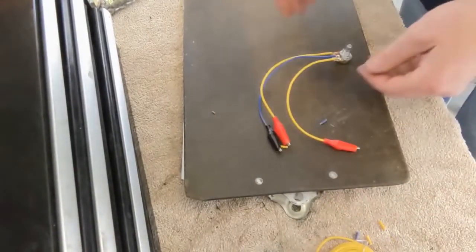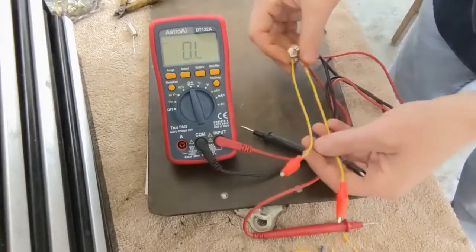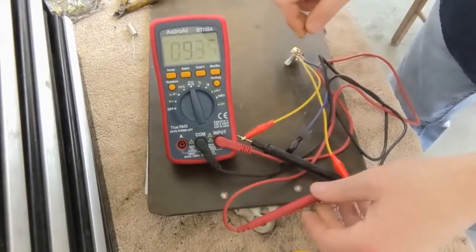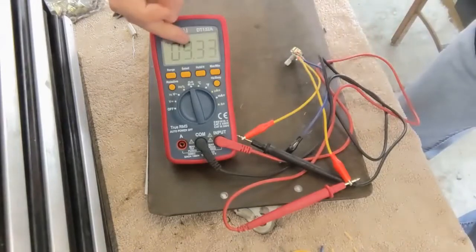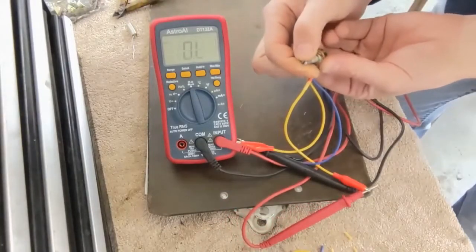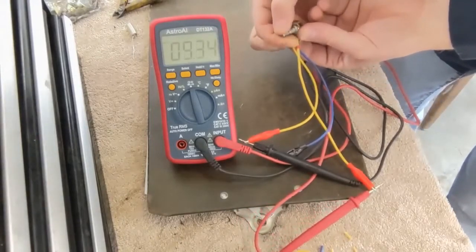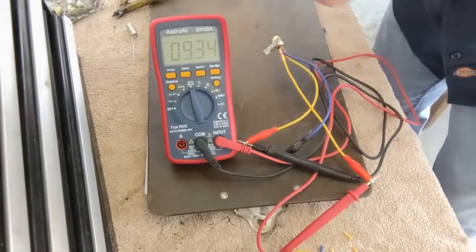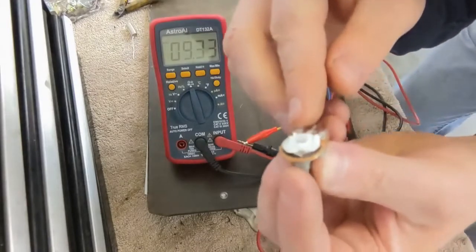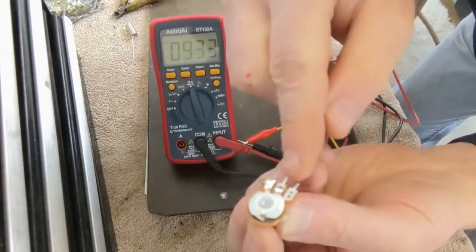There's the final product. Just to show what I was talking about — the two ends are its total resistance and the middle is the sweeper. If we hook up our meter set on ohms to the two yellow leads, it gives our total resistance: 9.33k, or 9,330 ohms. No matter how much I move the dial, I'm not changing my ohms because it's measuring the total resistance. You can see inside there's a carbon track — that whole carbon track runs along the inside.